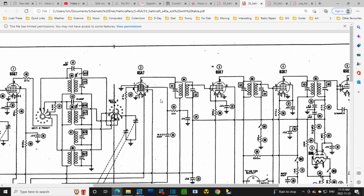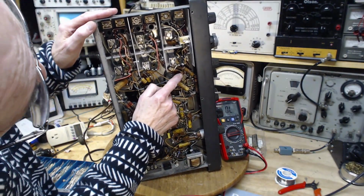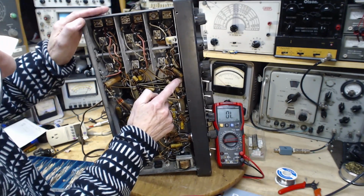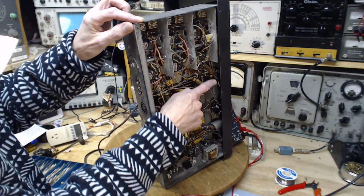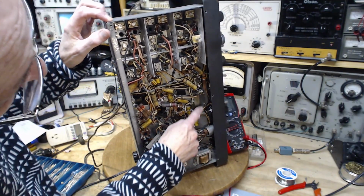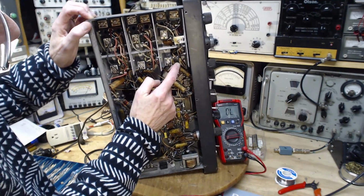Okay, must be another wire off the same pin. Oh. Okay. Let's just switch back here. I'm misinterpreting this. So we come off the pin of the tube and we go over to a terminal strip where 2 things are connected. This capacitor going back to this coil, and this big resistor here, brown, black, orange, this great big guy is 10K. Oh my gosh, there's a resistor hidden up in there. You got parts hidden away here. Just quickly looking for more hidden parts. No. So this guy's basically connected straight to pin 4 and then going up to this coil.